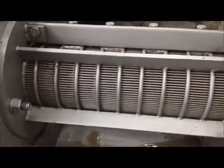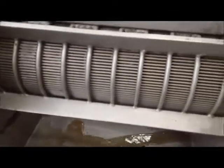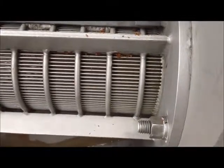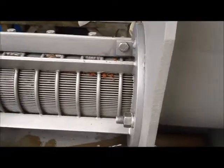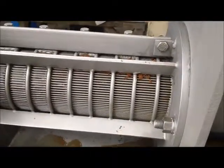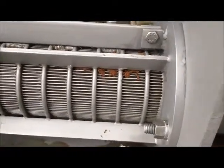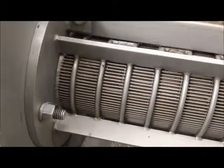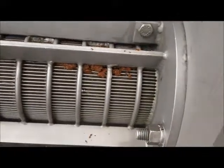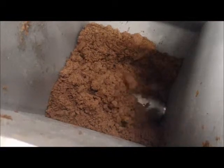We're definitely getting some liquid out at this point. If there's free liquid in the material fed to the press, you usually see it come out here at the inlet end of the screen. But in this case, there isn't that much in the way of free liquid — there's none. So instead, we're seeing the dewatering start at the high pressure end here and then work its way back as the press fills up. This stuff is spitting a lot through the screen, which says the screen's blinding in the middle.